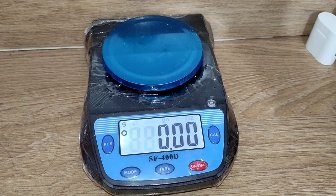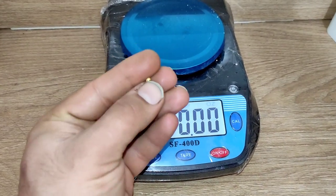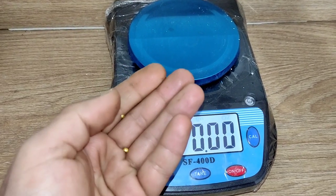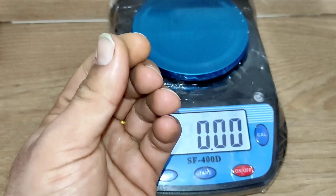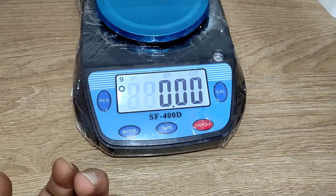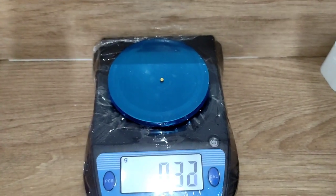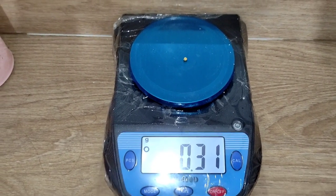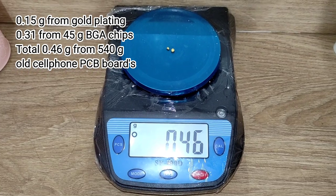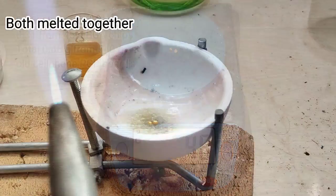Processing 3 kilograms of cell phones — or 540 grams of cell phone boards — is done. Here is the result from BGA IC chips, and as you saw in the previous part of this video, this is from all gold plated parts. Only 45 grams of BGA IC chips yielded about 0.31 grams, but in total we got 0.46 grams of gold from only 540 grams of cell phone boards.